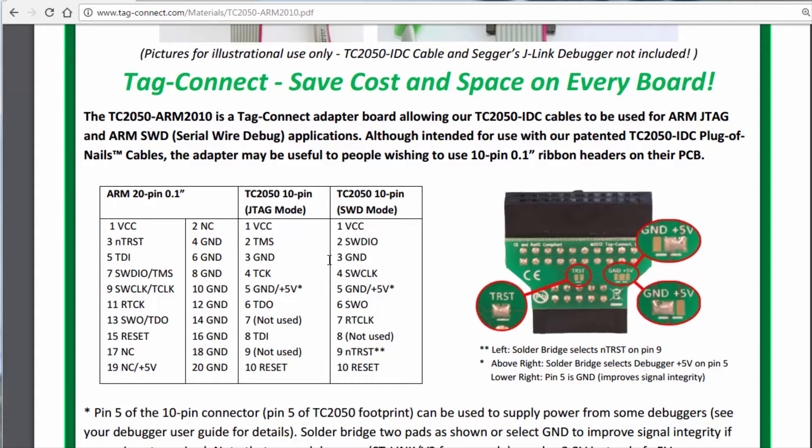Some of the other connections used for serial wire debug are the VCC sense line, serial wire data IO, ground, clock, and the reset line. Optionally, for the Cortex-M3 and M4 based STM32 devices, you can connect the SWO line for serial wire viewer debug functionality. You also have pins 7, 8, and 9 which are not used in serial wire debug mode. These can be used for things like triggering your scope, extra GPIO, or bringing a UART out of your target for printf-style debugging via a virtual COM port on the ST-link.